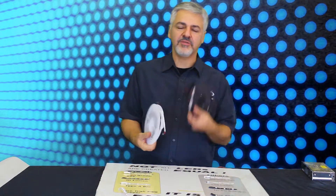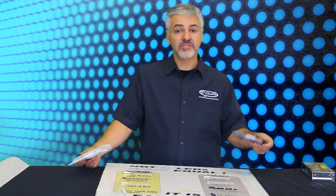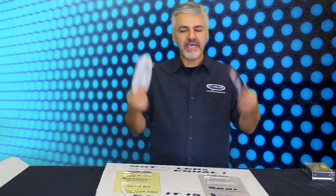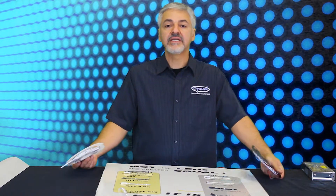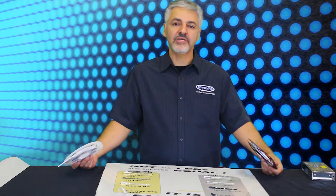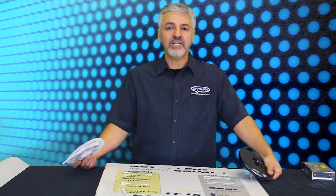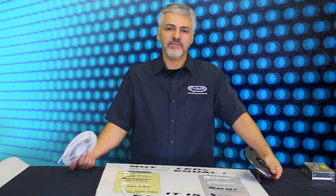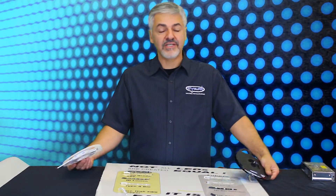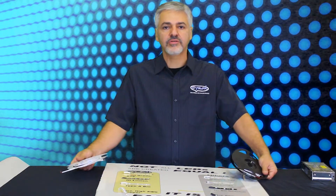So what makes the difference between a $9 and a $29 reel? I'm using those numbers as hypotheticals, but there's a big gap in price. There are really three main components that make the difference. One is the LED itself. Second is the copper tracing — the circuit that everything is mounted on, think of it as a wire. Third is the two-sided adhesive tape on the back. These factors dictate whether your lights are going to stay on for two days, two years, or 20 years.